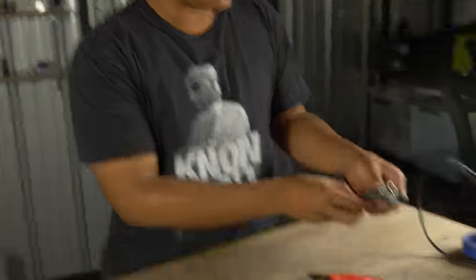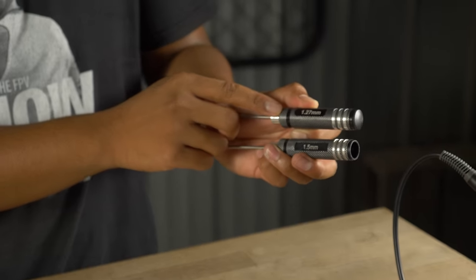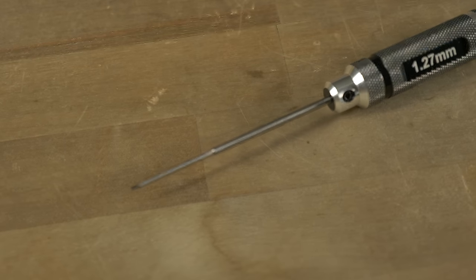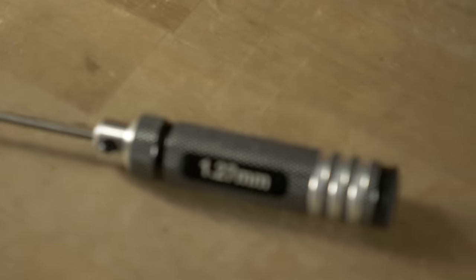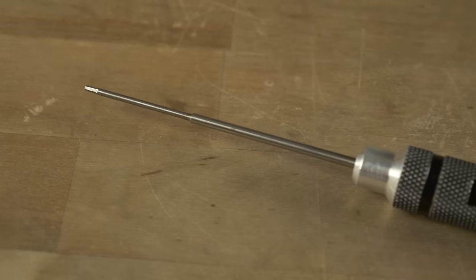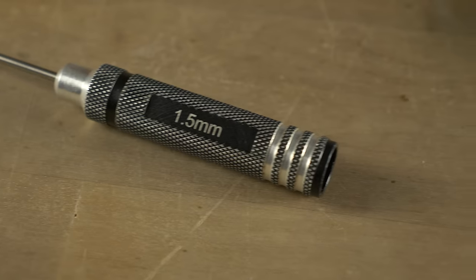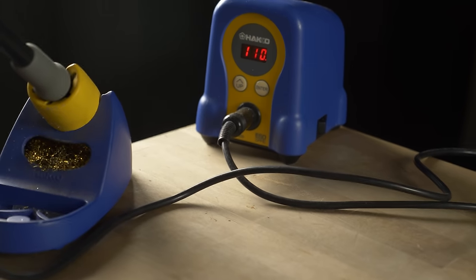To start, I want to go over the tools. Because this drone is very small, it uses some unique tools. I have a 1.27mm hex driver — the heads that come with the motors are 1.3, but 1.27 fits a little bit better and is easier for getting the screws in. Next we have our 1.5mm hex driver for all the frame hardware: screwing in standoffs and all that. Then we have snips, tweezers, and a soldering iron — that's all you're gonna need.